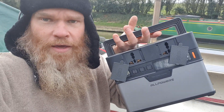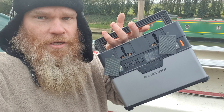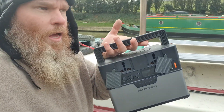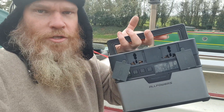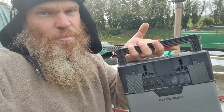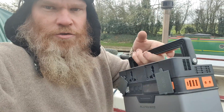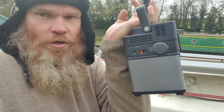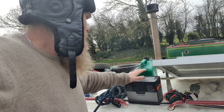It's a 105 amp hour all-in-one — it's got an MPPT controller in it, a pure sine wave inverter for about 300 watts. It's got a funky LED display so you always know what sort of charge your battery is at. It tells you just a percentage, not amps and stuff, but it also has USB, USB-C outputs, a 12 volt plug, and solar or 230 volt inlet.